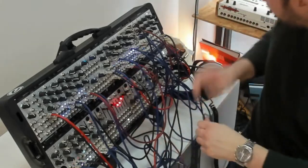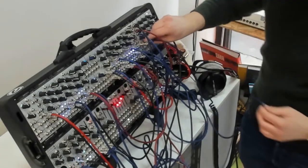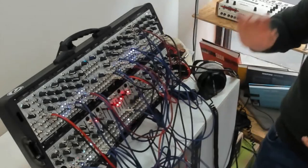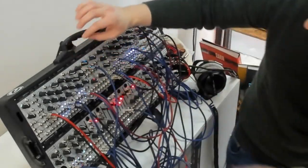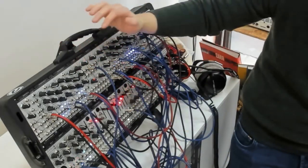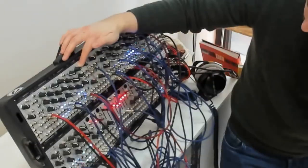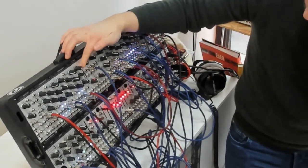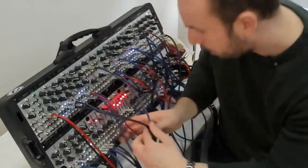And then there's another input, and that's the stage inputs. And this one is really cool because it can be used for analog control instead of sequential control. So we are creating just a simple fixed voltage with a select 2 into the stage input. And you will actually see that as I change this voltage, we are scanning through these stages. It's following the CV, and you can actually combine this.